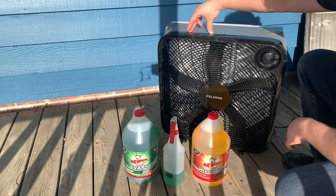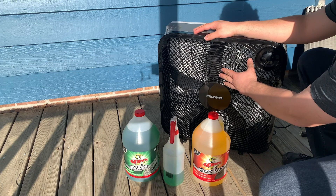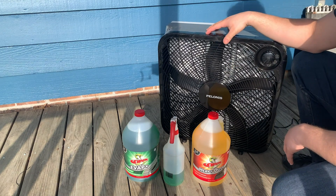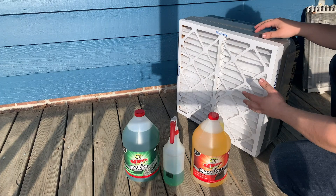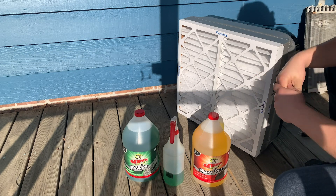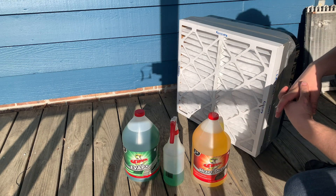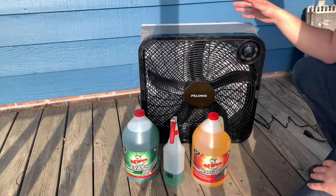This is not going to in any way protect anyone from COVID-19. This is a cheap and practical way of filtering the air in a time when people may not be able to have technicians come into their home, open up their ductwork, and install an induct media filter with upgraded filtration. This is something that everyone can do right now for under $100 to help filter the air. You could use an activated carbon filter, which might have a larger pressure drop — be aware of fan speed — but that would take care of VOCs. The higher the MERV rating, the more particulate you'll catch efficiently. This is not a cure-all and will not save you from a virus, but it can help clean the air — and since we're going to be inside more often, making sure what you breathe is clean is worthwhile.